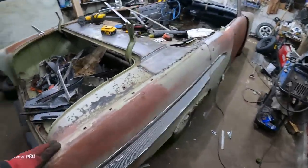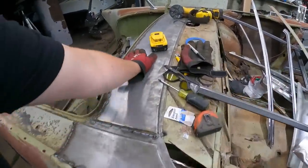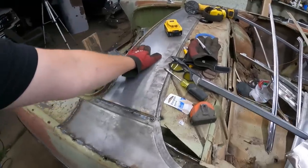Okay, well, all the welding later. So I'm moving around, making spots, stuff like that. I don't want to put too much heat in the panel, but stay nice and flat. I got no real worries there.